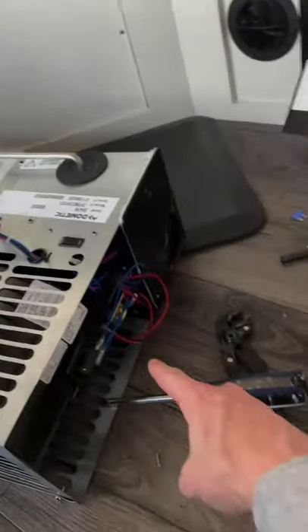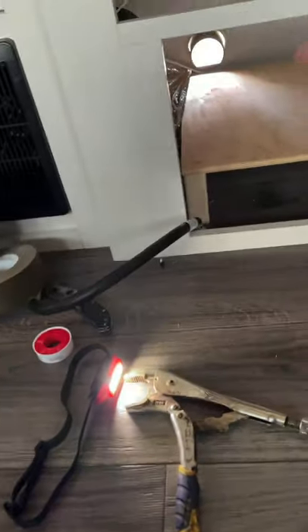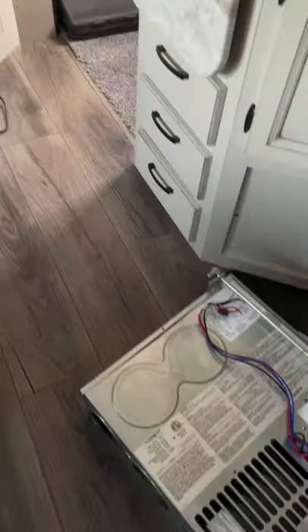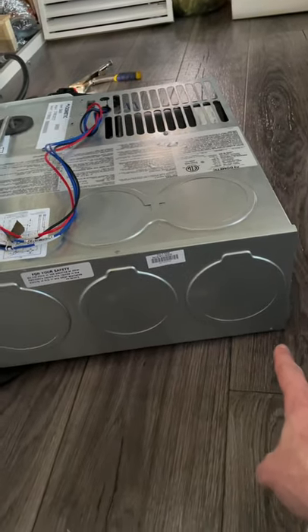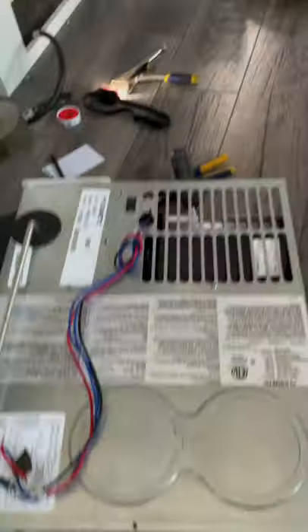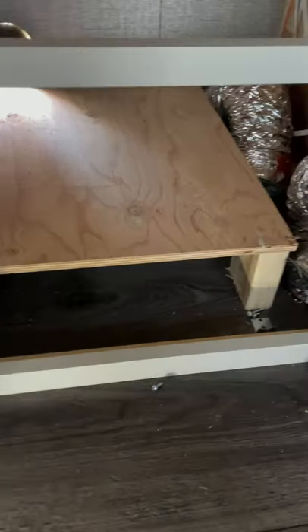Okay, that's the unit. Here is the sail switch — it sits on this side, the side that sits against the wall naturally. Of course they wouldn't make it so you could access it easily. This is the side you're going to be looking at when you take that cover off. The only screws you really need to worry about are the bracket screws that hold this thing in. There are these brackets and just a couple screws — you take those out and lay them to the side.